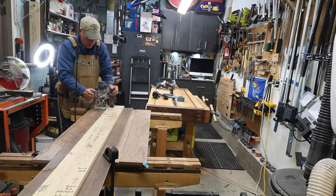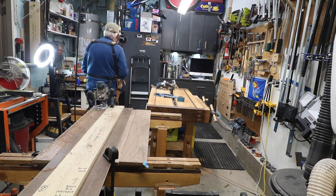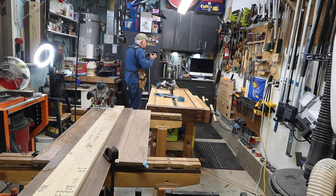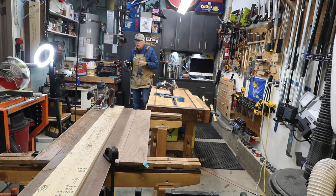I was working too hard because I plunged it all the way down, so I should have run it in two passes. Smelling black walnut like crazy, so I should learn to put on my dust mask. And that was screaming so I should put on hearing protection — but other than that I didn't do anything wrong.